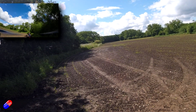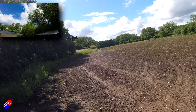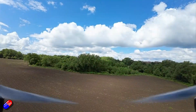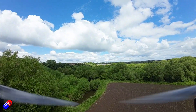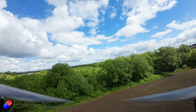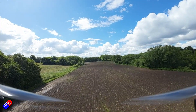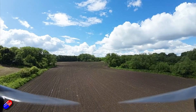Noise was a little less than expected — I'll shut up and you can hear it here. Not screaming by any stretch of the imagination, kind of the standard noise you would expect off a lower-powered five-inch quad. However, this is a capable six-inch setup, so it's actually nice and quiet. Maybe part of that additional noise reduction is coming from the fact that the air isn't hitting standard arms. I'm using about 500 milliamp hours out of my battery about every four minutes, so I can get around 10 minutes out of a 1400mAh 6S battery.